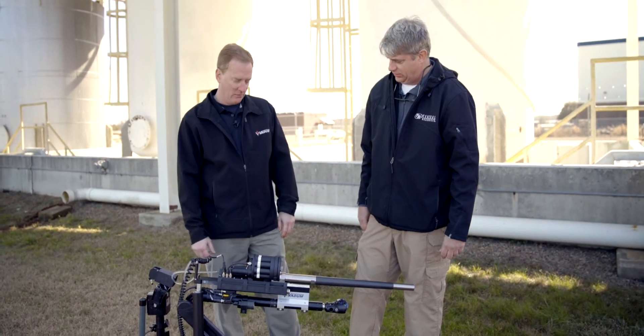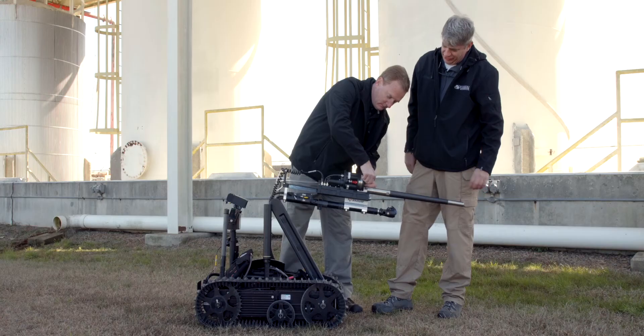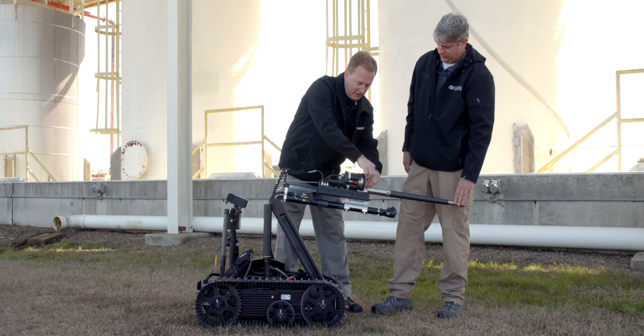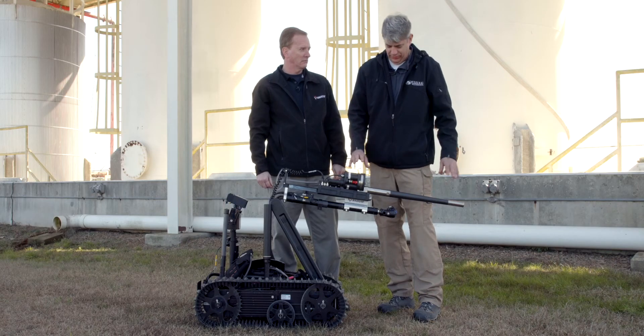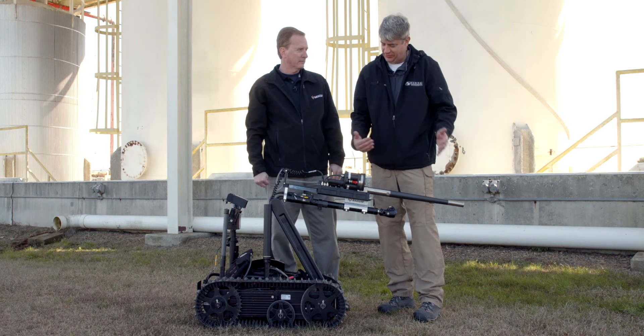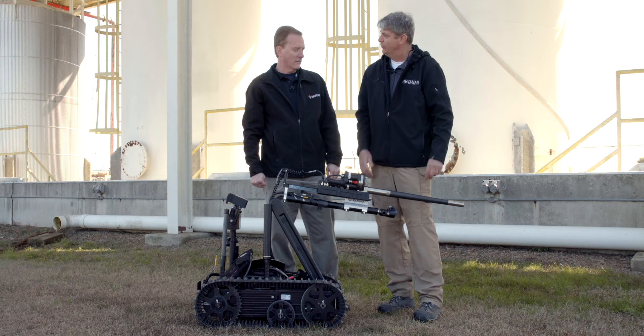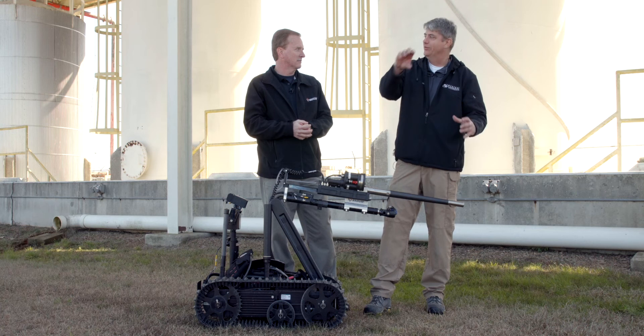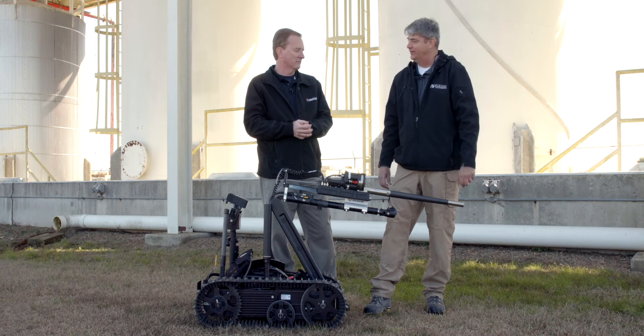This is a way that you can put these on smaller and smaller robots. How many shots do we have with this system? If you're doing all projectiles, you can do eight. If you're doing at least one water shot, you can do seven total. How long does it take between shots to reload and reshoot the weapon? If you're doing a slug-to-slug, it's about three minutes. If you're doing a water shot, or any shot to another water shot, it takes about five minutes. But that's still much shorter than it would take to bring a robot back to you, load your plugs, fill it with water, and load a blank round in.